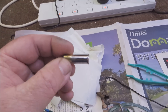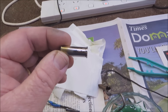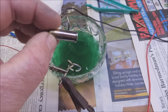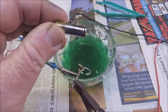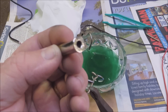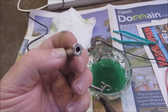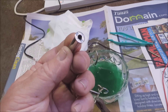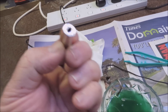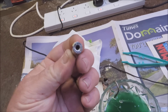All I would have to do is put the alligator clip on this end and put the end I'm holding in — or you can actually put it on a bit of brass wire and dunk the whole thing in, move the whole cartridge. Whatever you want to plate, as long as it's all in solution it'll plate nicely. Just experiment — you can do it for 30 seconds, a minute; some people do it for up to eight minutes. I can put this in a tumbler now, or I could buff it, and I can't buff off that nickel plating, so it adheres very well.